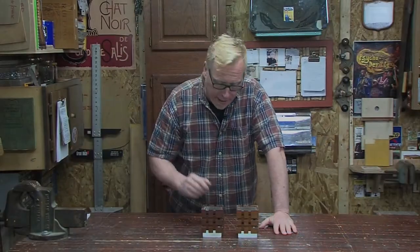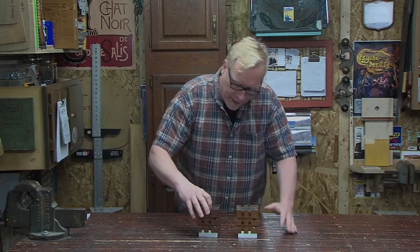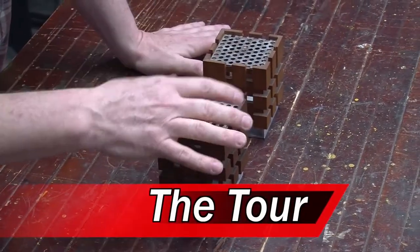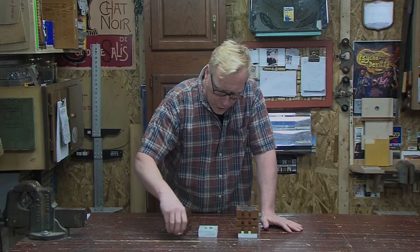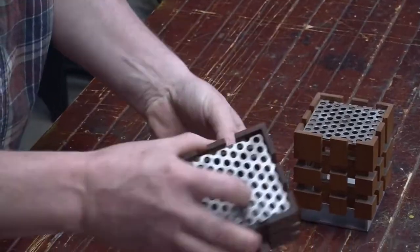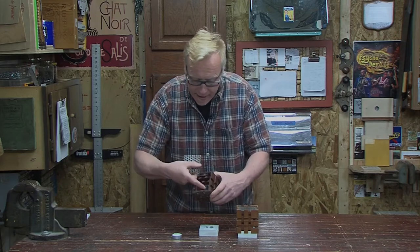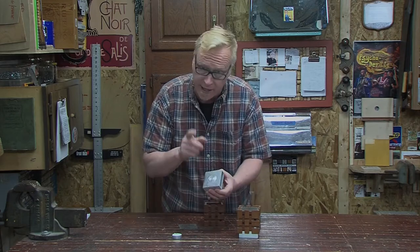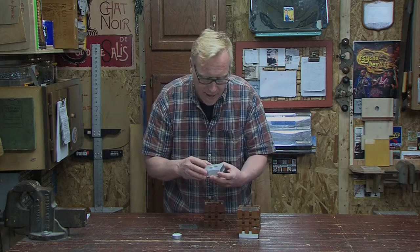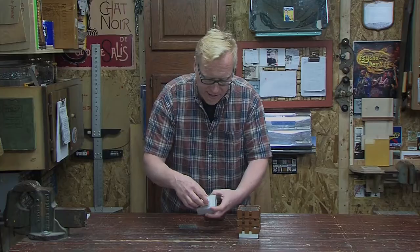Let's have a look at our project. These small tea lights make a great impact on the dining room table. First of all, they're made out of mahogany, a really nice wood. We're using half-inch thick stock, we're going to mill it down, and we're using aluminum channel for the base. The base fits into a rabbet that we'll cut on the bottom, and on the top we're using some perforated stainless steel metal — it fits in a rabbet as well. I've just taken a Forstner bit afterwards, once our aluminum channel is cut to size, and made a little indent so the tea light nestles in there.